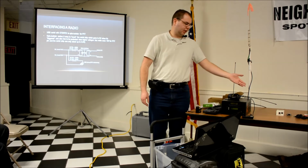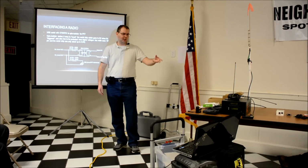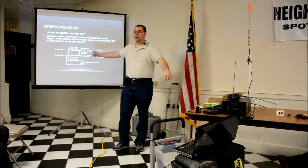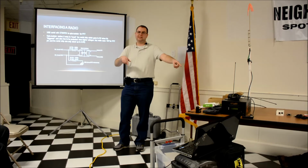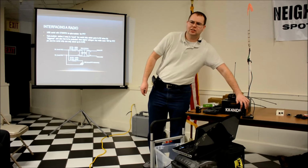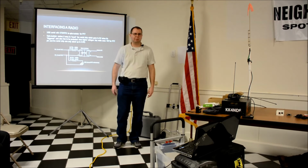One of the things that the Raspberry Pis don't have is a power button. You have to either log into it and tell it to shut down, or what I did is I put one of the case power buttons across one of those input-output pins I talked about earlier, and there's a little task that runs checking whether it's high or low. When you push the button, it sees it goes to ground, and it initiates a system shutdown. Then the display goes on shutdown, and it prints out, I think, terminated or something, and you give it like 10 seconds and the lights all stop blinking.